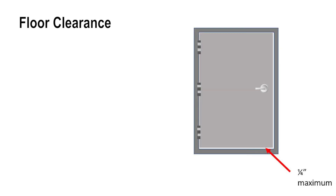The required floor clearance is one quarter inch. In the case of shutters, that one quarter inch is between the shutter and the sill. It is common with hollow metal that if a door will have less than three eighths of an inch undercut, the door will need to be priced as the next larger size. Shutters use a Paladin door. The LM 9300 does require a maximum of a quarter of an inch undercut.